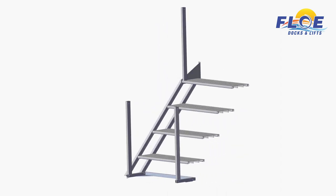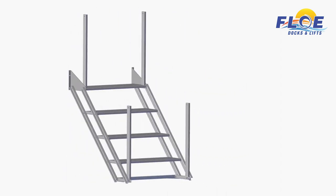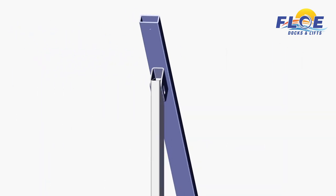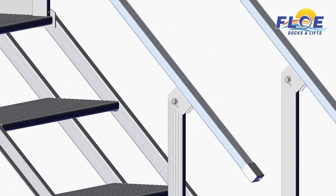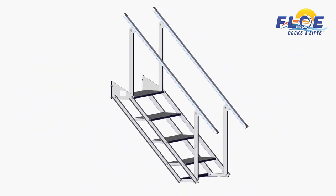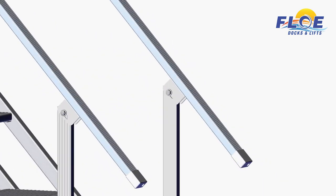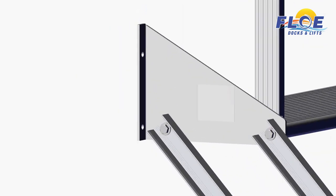Add the two stringers to the other side of the assembly, and repeat the same process. Add a handrail to the top of the support and attach with a bolt, washer, and nylock nut from step 2 on your hardware card. Do not tighten. Repeat this process to the handrails at the top of the other three supports. Insert the included carriage bolts and nylock nuts into the mounting brackets at the top of the stairs on each side, as shown.